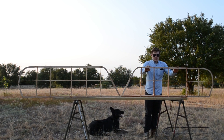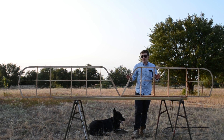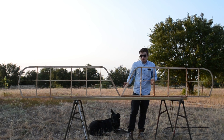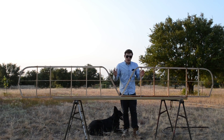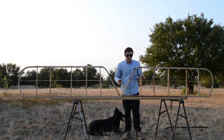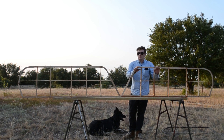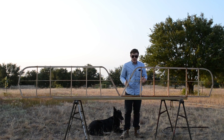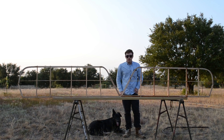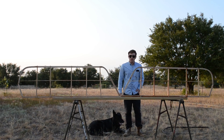One interesting thing about the stabilizer is that the trailing edge is actually made in a whole bunch of different pieces. The straight parts of the trailing edge and the curved parts are separate and joined with scarf joints, which makes it a lot easier to build than if it had been one piece. Because I'm unable to do steam bending, I had to make the curved parts using lamination. I take the ash and cut it up into really thin strips, then soak it in a bathtub overnight, and then glue and clamp it into a jig — that works pretty well as a substitute for steam bending.